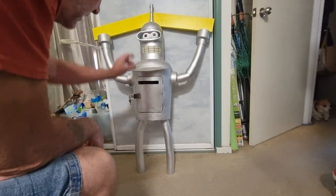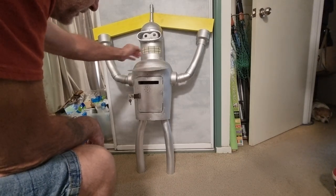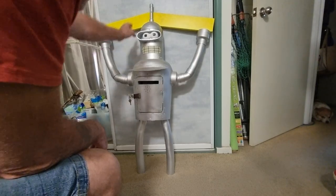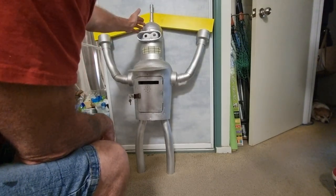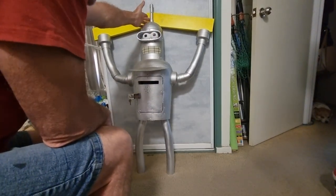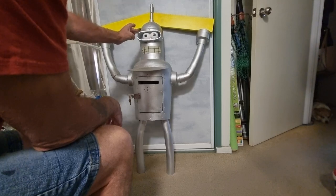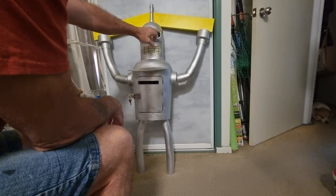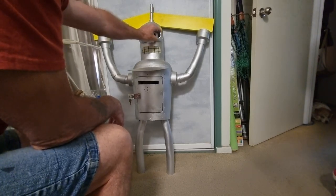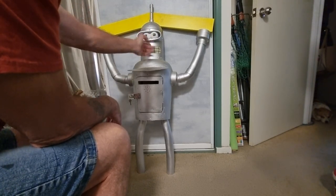The base here is another piece of wood. This here is a few pieces of wood that I've glued together and turned on the lathe to basically be Bender's neck — the transition from the body to the head. The same up here: this is a piece of wood that I've turned on the lathe to fit the top of his head. The top piece is just a small piece of 16mm conduit that I've glued on top. The eye socket is a piece of wood that I made into an oval shape, then heated up the plastic and clamped it around the wood until it cooled down, and I've got a join on the inside that I've pop riveted on to hold that shape.